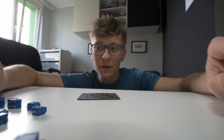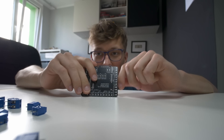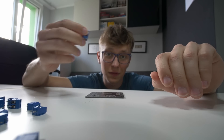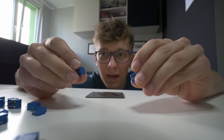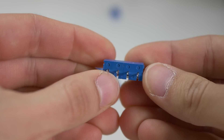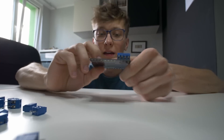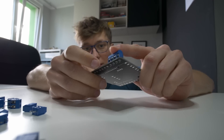Usually when soldering, you should start with the smallest components first — that's usually true — but in this case there are a lot of screw terminals, so I think it will be easier to start with the screw terminals. Here is a small tip: you have these two-port screw terminals and you can easily connect them together. There is a small tab on one side and a small hole on the other, so you can connect them to create a four- or even six-port screw terminal, and then easily plug it to the PCB and solder it.